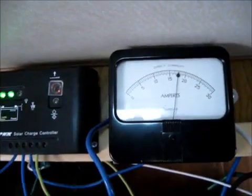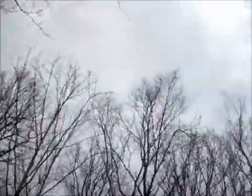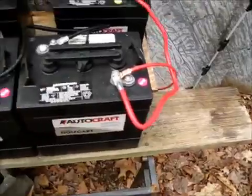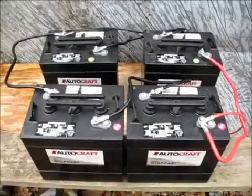The sun is not yet fully shining. It's just a grey, overall more white actually — a solid covering — and I'm actually pushing nearly 20 amps with that cloud cover with three panels. This is amazing. I had forgotten to do this yesterday — I just switched out the wires. I had the minus here and the plus here, and I switched it so now it's minus on one end and plus on the opposite end of the battery bank. Thanks guys for the reminder.